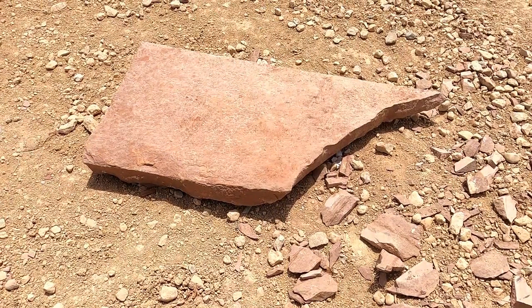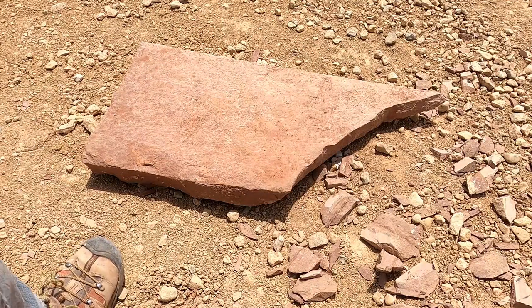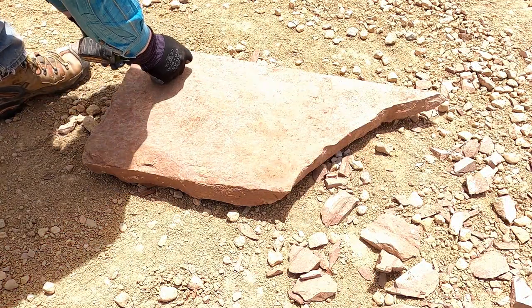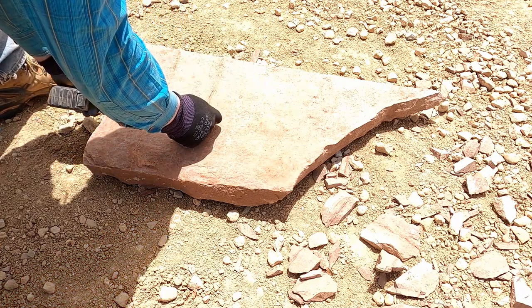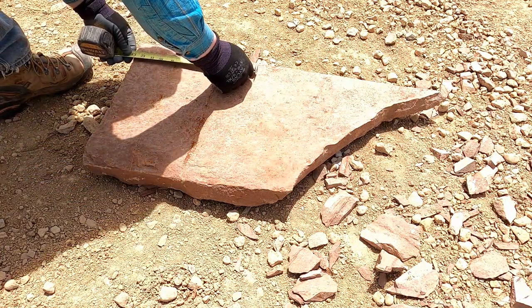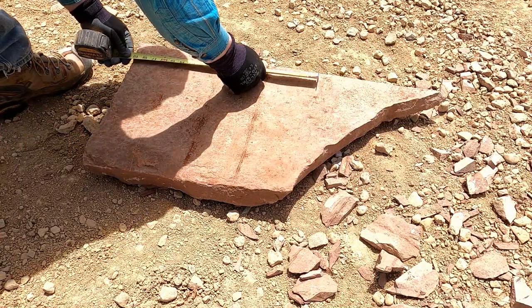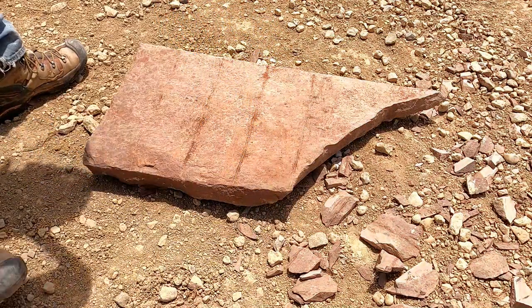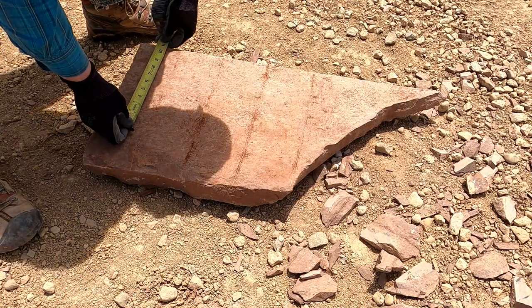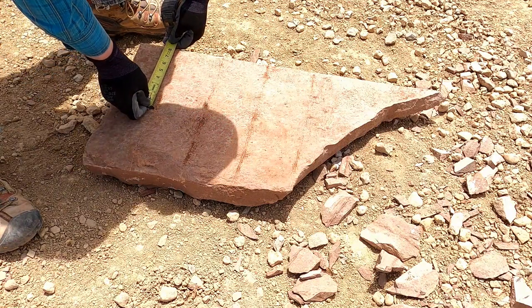Okay, so we're gonna build our own bricks. We're gonna make it so that we have a 4.5 inch by 8 inch brick. We're gonna build it out of stone. So you scribe this at 4.5. Then you go 4 5/8 for your blade width. You go 4 3/4. 4 7/8. We're gonna make them at 8 inches long. Kind of wasted that stone.